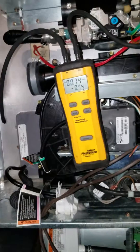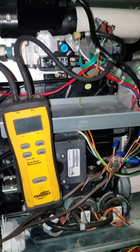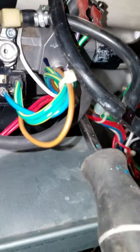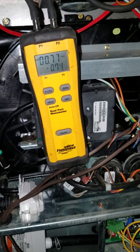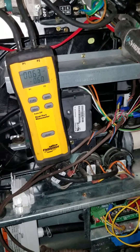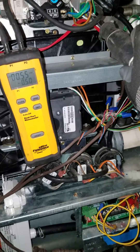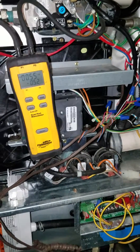Blower just kicked on and my gas valve kicked down. Low gas pressure — and that screw. I'm going to start turning it in and it's probably going to need a bunch. So I'm just going to go a bunch. There we go, we're dropping. I'm going to try and get it close to 0.50. There we go. 0.55.